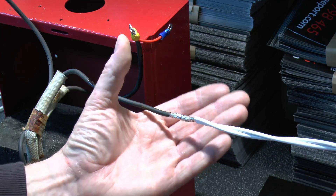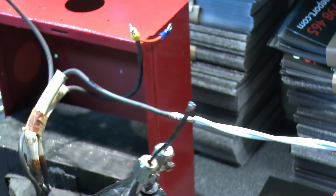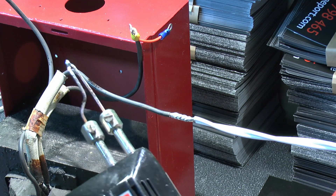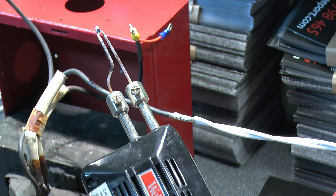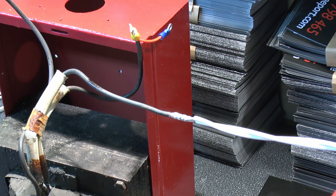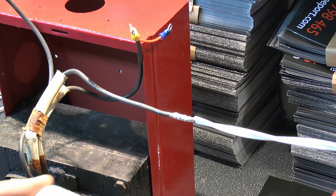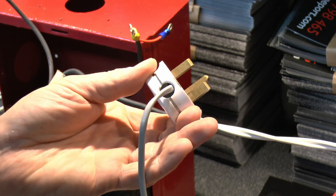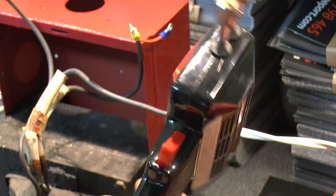So just wait for that to cool and then we'll apply the heat shrink. Now for soldering something like this you can't use a little soldering iron because of course it's too puny. This I think is 100 watts — 100 VA anyway — so it needs a decent amount of power to get the heat into the joint. And nice unsleeved pins there, which just shows you how old this thing actually is.